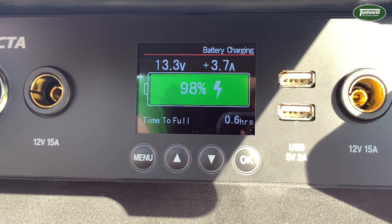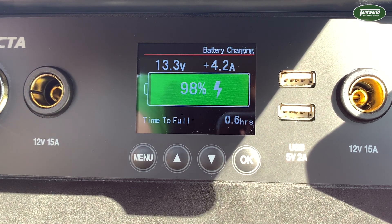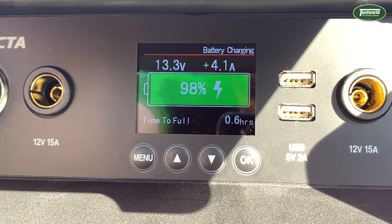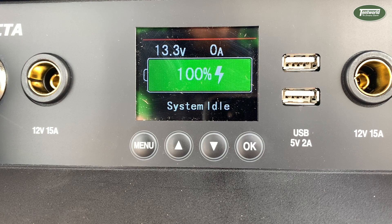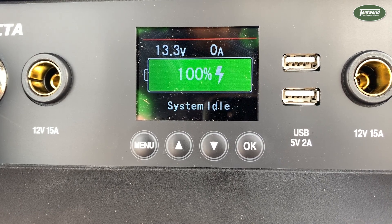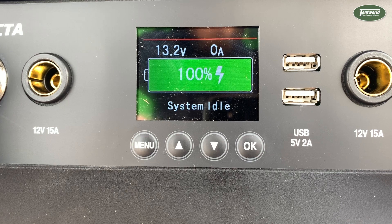As you can see, with it plugged in our battery box is getting a nice 4 amps draw from the solar panel. Output will vary with clouds or shade coming across the panel. That 6.63 amps is the absolute peak current under the most ideal conditions, so getting roughly 4 amps at 4 o'clock in the afternoon in Townsville is actually really good. Now that our battery's at 100%, the regulator has cut off the supply from the panel — the net amperage goes to zero. Every now and then it will trickle a little feed from the panel to the battery to top it up, rather than overcharging it with the full supply.